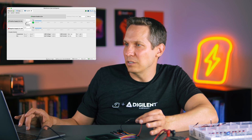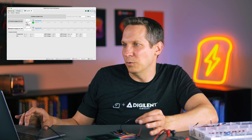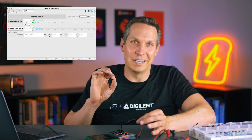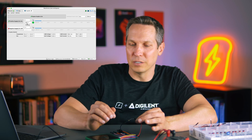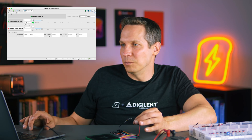So the master enable is on, and look — it's producing about 1.002 to 0.999 to 1.003. You see it's fluctuating a little bit. You'll find that nothing in engineering is as exact as you probably want it to be. So right now this resistor is getting one volt over it, acting as a supply. Now let's use the Discovery 3 as a voltmeter.